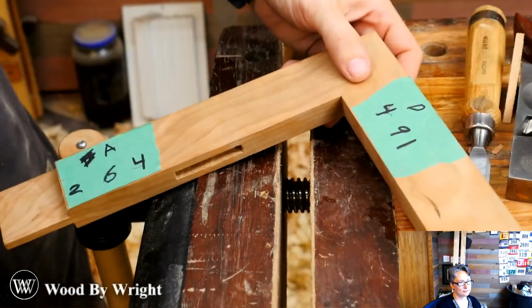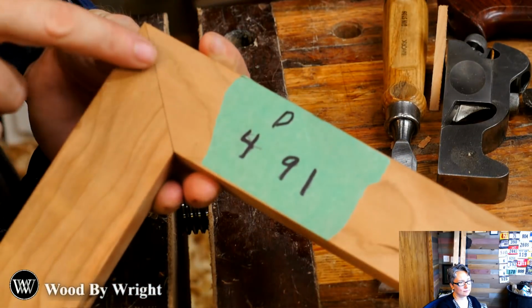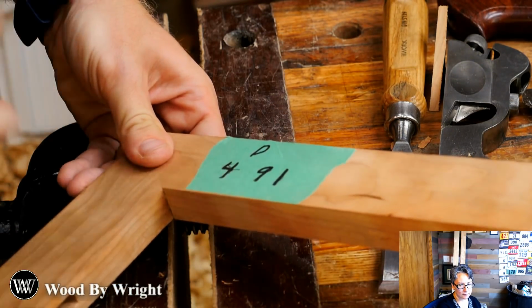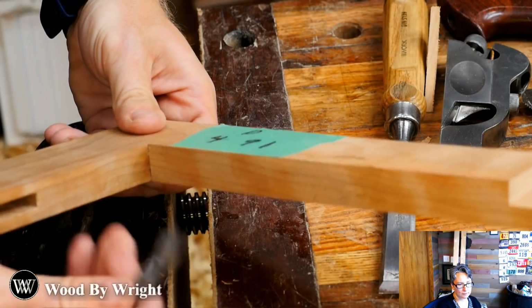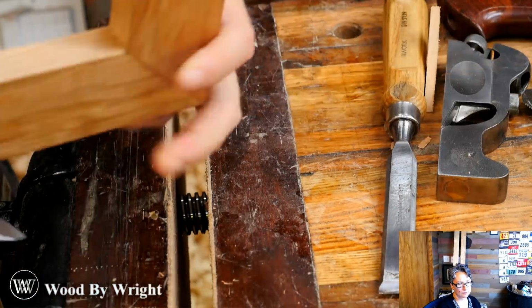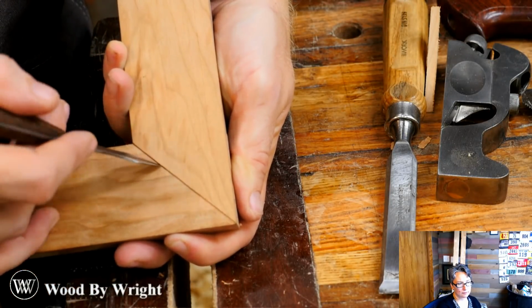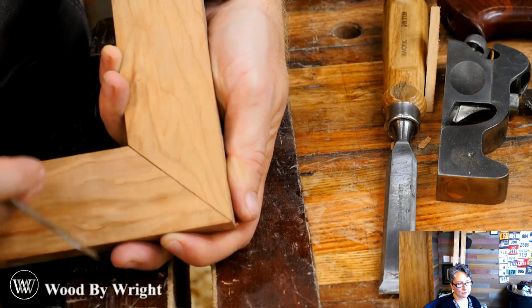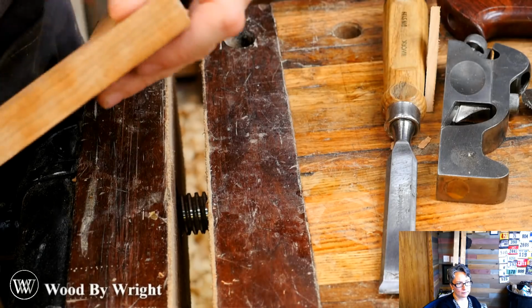There's a slight problem on here. Not a huge one. But let me show you any little defect on this. On this side, this is just perfectly smooth, nice tight joint right there. I'm very happy with that. You can see a tiny bit of gapping here. Grab my knife. And here, where when I came into the chisel, I undercut it a bit too much right by the edge here, rather than leaving the edge hot. And then on the back side here, it's tight all the way along here, but on this side where I came in and undercut it, you can see how I undercut a little bit past the line. And I realized I did that afterwards when I was cutting it, but oh well, that's on the back of the joint. But everything else about this, really nice and tight.